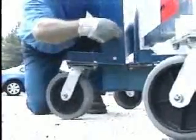Turn the entire assembly right side up. Attach the upper vertical section of the stirrup with the provided 2 large nuts and bolts. If you are using a walk-through stirrup, attach a stabilizer wheel so that it extends outward away from the platform.